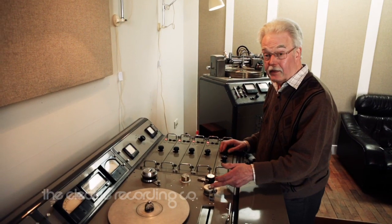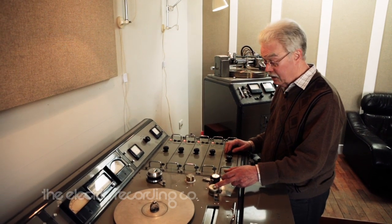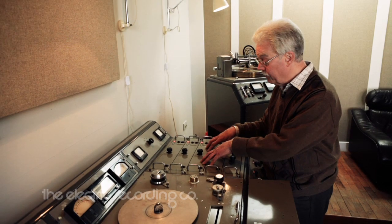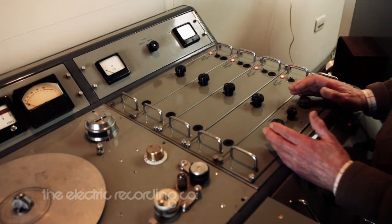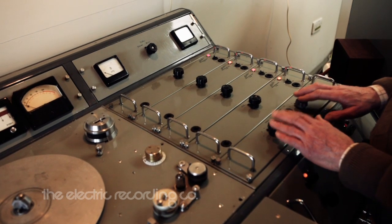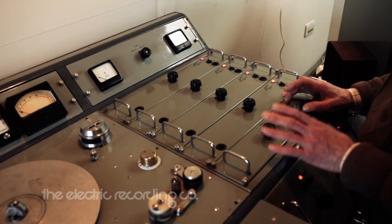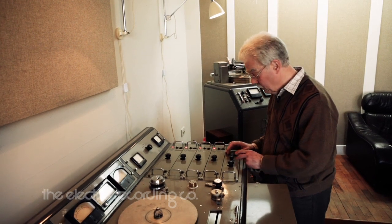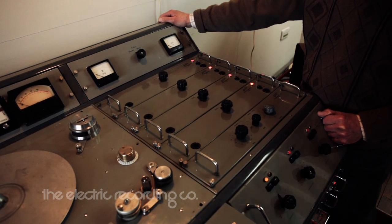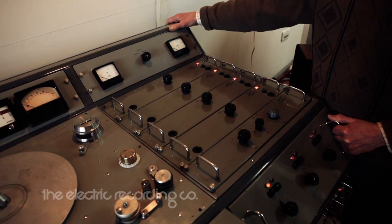Having got the signal from the audio playback head, it goes into two of these pre-amplifiers. The preview heads go into the other two, and then they all go through just about enough equalization that you can raise or lower treble or bass with different curved shapes. We now go to the cutting amplifiers, for which we have to move the console out a bit.